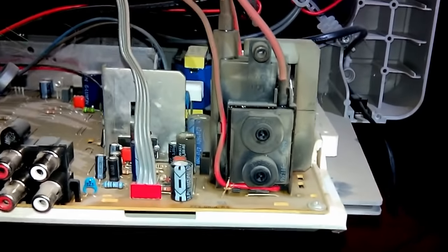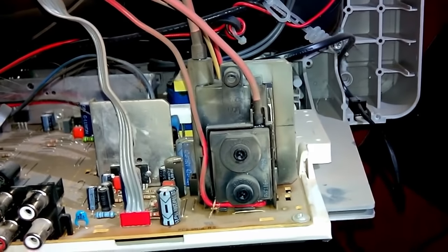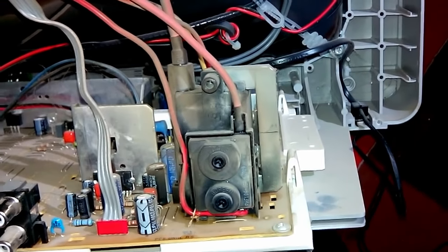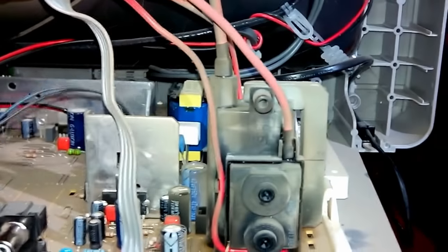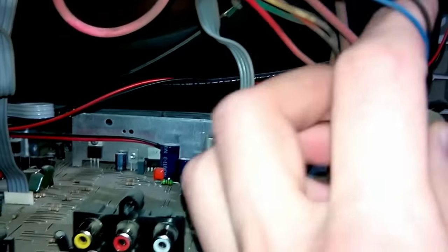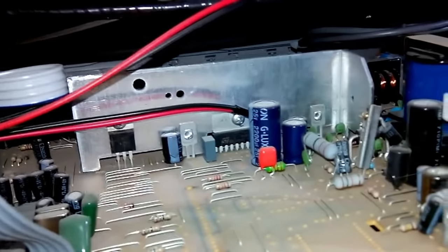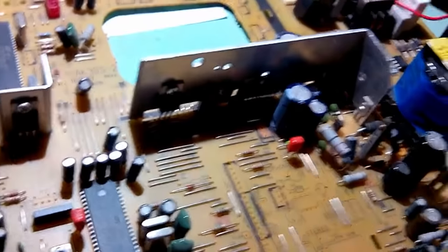Now I'm very inclined to think that it's really a dried up electrolytic somewhere which has too high ESR, which causes the supply to have problems starting up because of too much ripple on the output, and not a short on the output, because power supplies usually squeal when they have a short on the output. This one just ticks, kind of. It starts up, then sees excessive ripple and shuts off. I need to take the chassis out, what can I do? No obviously bulged stuff. Damn. Alright.